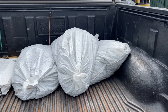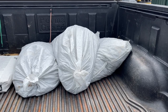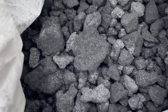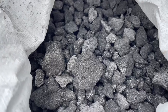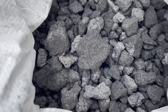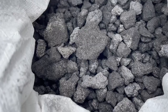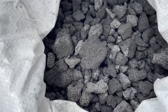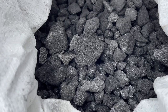Here's what I came to get — coke for forging. So right here's what we went after at the Blacksmith Depot. This is coke; it's a byproduct of coal when it's burned, and this stuff is the best for using in a forge for heating metal. There's almost no smoke, and if you take the air off of it, it goes out really fast. It lasts a lot longer — it's way better than coal. I got three bags of this coke because if we're going to be working on grain mills, we've got to have the forge hot.